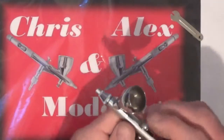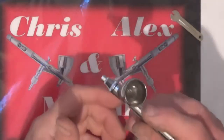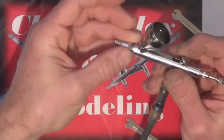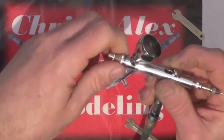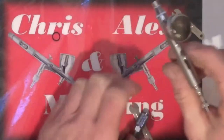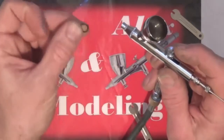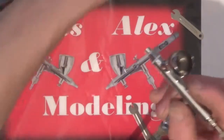It sounds like it's blowing out there. Yep, that's what happens when you put the O-ring with this seal part — it blows back. So we'll take that off. It must be the spacing that an O-ring gives that part there that actually causes it to blow back up here. So even a very thin O-ring won't work — it must be a fiber washer or nothing. But I do find it leaks without it, which is a bit frustrating.